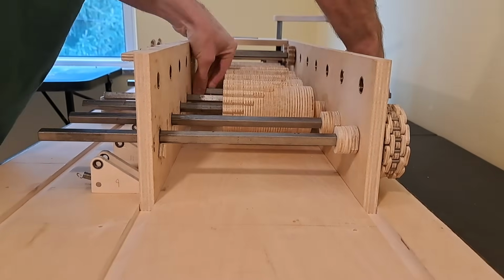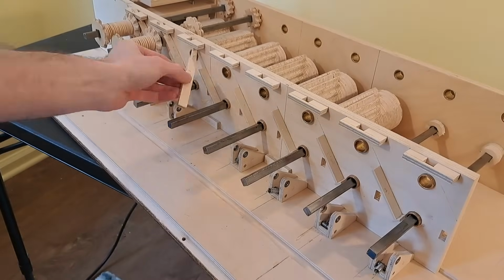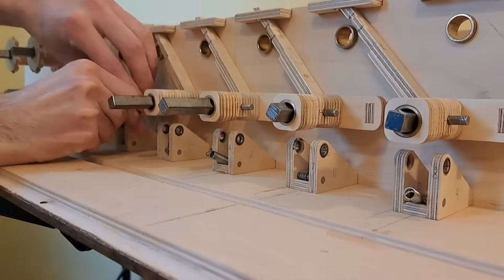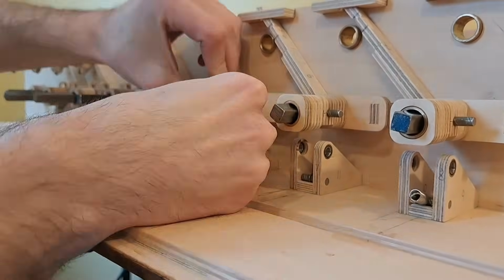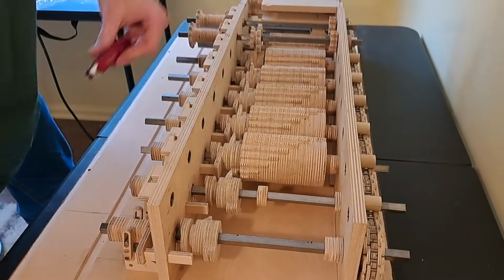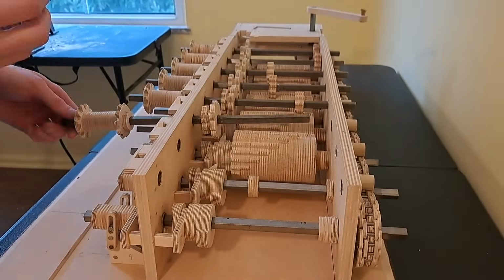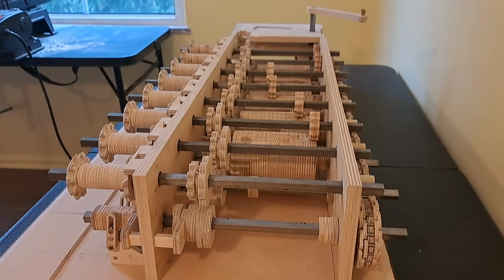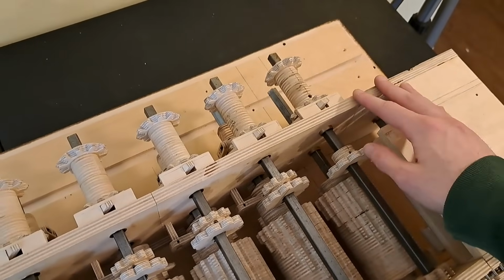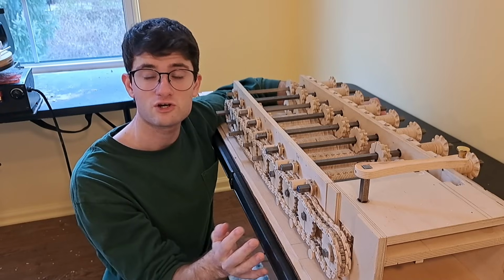Let's put all those pieces in place for all 6 of the drums, and 2 more columns that'll only perform the carry operation, to allow larger resulting numbers. With those spring-driven brackets, all the carry levers are now very clicky and certain. It's starting to really come together now.